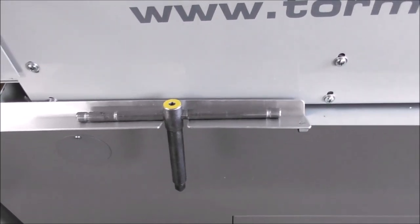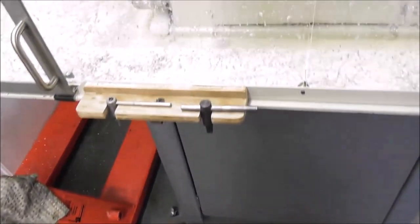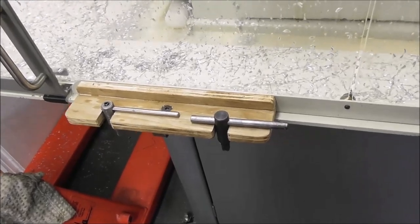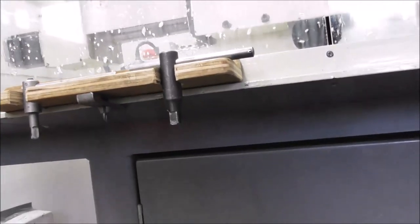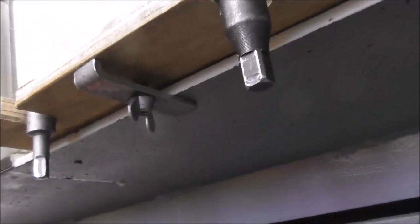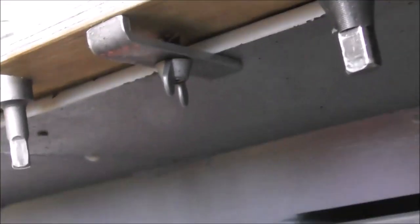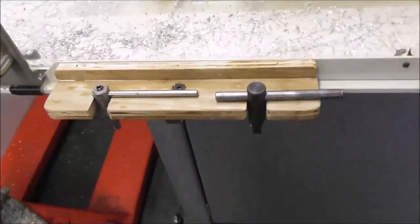So I put a little aluminium insert over the top, and that got me thinking, well, that would be a handy little thing to have on the mill. So I made another one up for my chuck keys when I'm doing chuck work on the mill, and all it is just a little plywood part that clamps on underneath. Just a little clamp plate and a wing nut underneath, and I can slip it on one machine or the other if I'm doing that type of work.